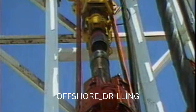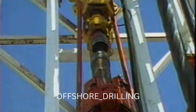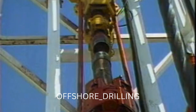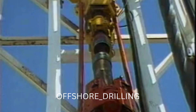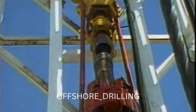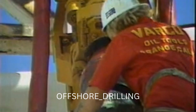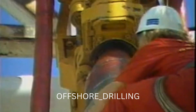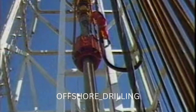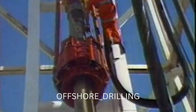When running casing, the drilling system is left in place and longer links and standard casing tools are suspended from the link adapter. As each joint is added, the driller can open the remote Kellycock and pump mud into the string through the short length of hose between the drilling shaft and the top of the casing. Should a tight spot be encountered, the spider slips are set and the elevator released and the casing is stabbed into the casing swedge and made up. Now the spider slips can be released and the casing rotated and reciprocated through the problem area.